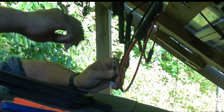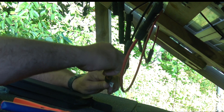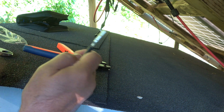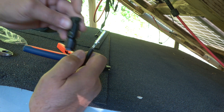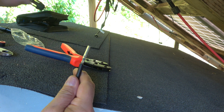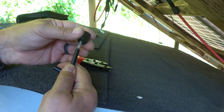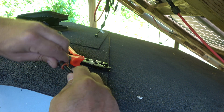I can zoom the camera in a little closer. Nice, good crimp — look at that crimp. That's perfect, that's just what we're looking for. So the next thing we're going to do is get our end piece here. Once we have that part on there, we're going to disassemble this and you'll have the piece on the inside — that's our compression fitting with a rubber seal. The first thing you want to do is push this down onto the wire, and then insert this piece, which is our rubber seal.